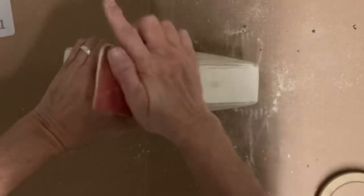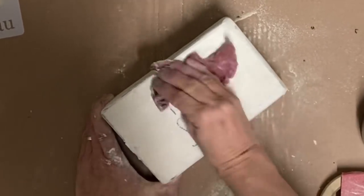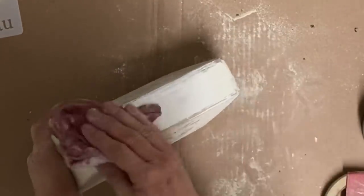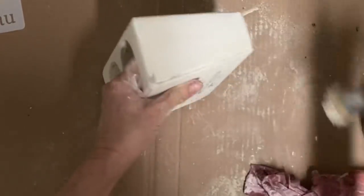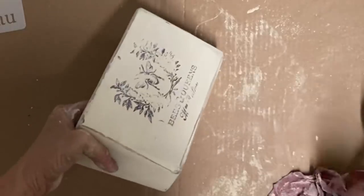Then I go over this with sandpaper — I could have just used a baby wipe and water distressed it, but I wanted quite a bit of distressing on the edges. Then I'll go over it with a wax. Generally I would use a clear wax here but I've already got my white wax out, so I'm just going to use that and wipe it off well where the stamp and decoupage is. It was a little harder to wipe off on the decoupage, so I'd recommend clear wax, but if the white wax hides your image too much just put some clear wax over it and it'll help wipe that off much better.